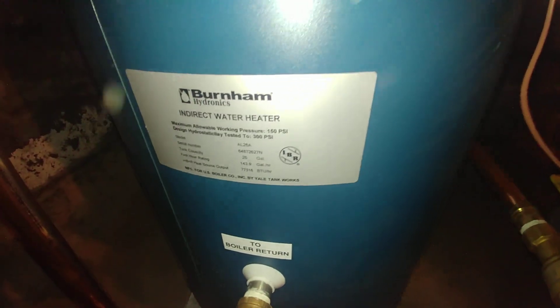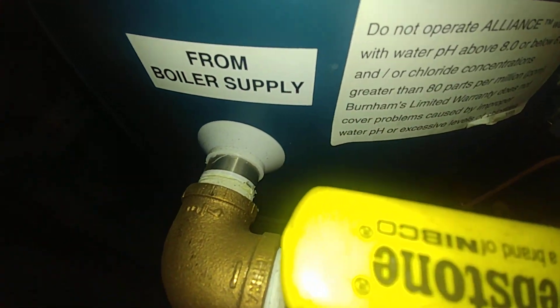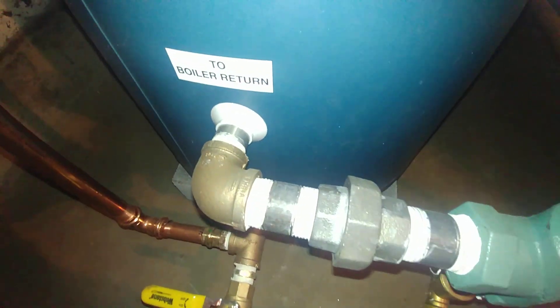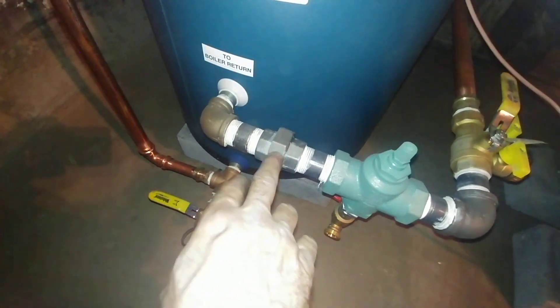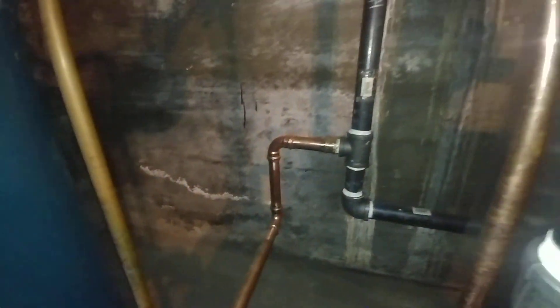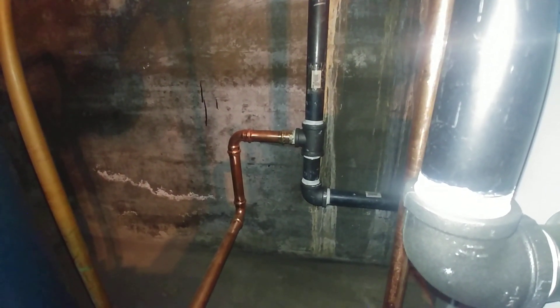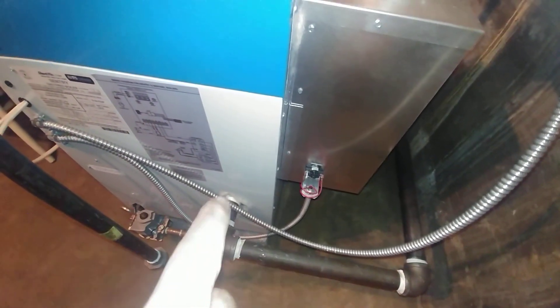The instructions call for one-inch supply — there's the shot of it. They no longer make this size or model; these are old stock from the boiler supply. This is a stainless steel three-quarter-inch nipple, coming out to another stainless three-quarter nipple, then a three-quarter-by-one brass fitting. There's a one-inch union for servicing, a flow check with drain, and into another Webstone purge station, then back via copper pro press into the return — that's an inch-and-a-quarter-by-one tee.